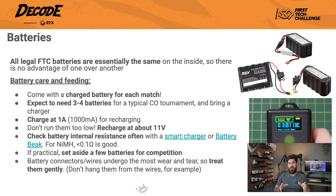For a healthy nickel metal hydride pack, you want internal resistance to be under 0.1 ohms. You can get yourself a smart charger or a battery beak, but those aren't the cheapest options at about $150 a pop. If budget is an issue, another way is to get a 10-ohm resistor and a multimeter and you can measure that internal resistance for under $3. Let's take a pause — I'll show you how you can do that with a multimeter now.